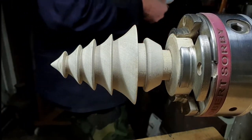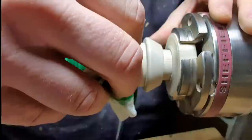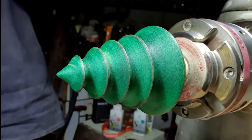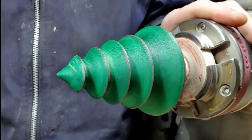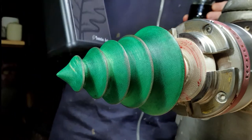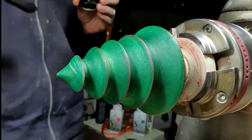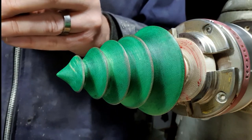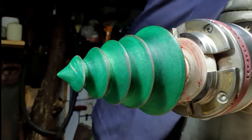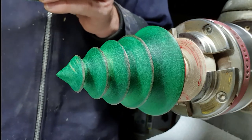We'll ebonize over the top of that when it's dried and we'll see how it takes the color. This big fat trunk will catch a little bit of the color and ebonizing, so just to clean it up right at the end I'll run a chisel across it and bring it back to the bare sycamore to make all those edges nice and crisp. So, color — we're going to do green here. I turned the camera around just to get my big fat hand out of the way of the lens. The first thing we need to do is get some tannin juice and a foam brush, then get plenty on there.